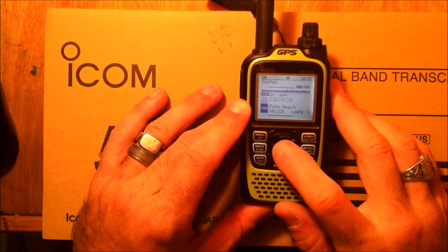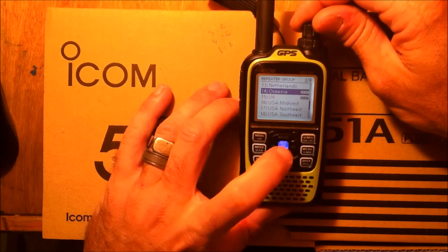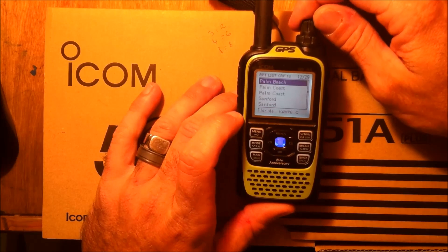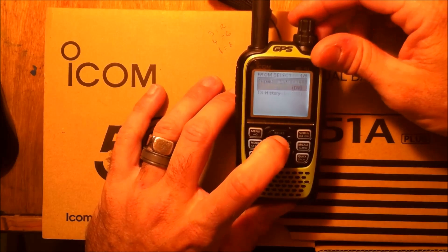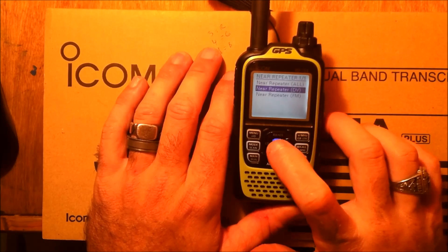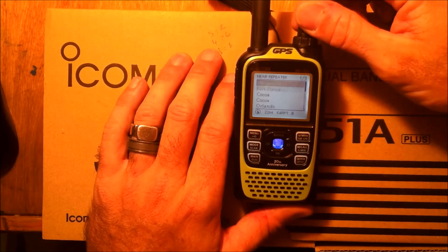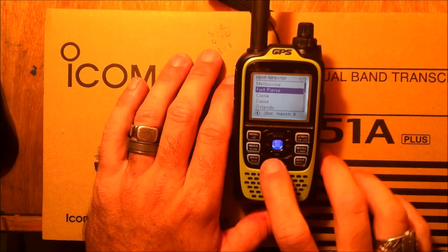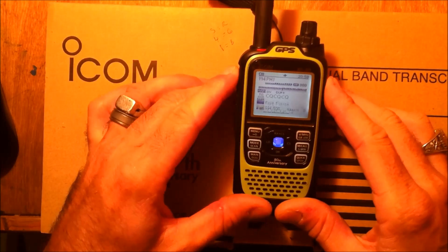There's a repeater list which is worldwide. I can go here to Oceania and pull up a repeater list in the New Zealand area, or USA Southeast — Palm Beach, Palm Coast, Tallahassee, Tampa. But you can also go to near repeater and choose all, digital only, or FM only. We'll go to digital and do a near repeater search. It pulls up by GPS the repeaters closest to me — Melbourne and then Fort Pierce at 22 and 25 miles away. If I want to talk on the Fort Pierce machine, I push the blue button in the middle, it locks in the frequency and call sign, and I'm ready to transmit.